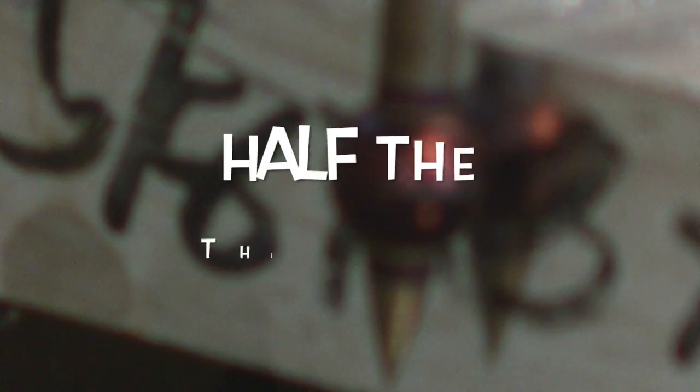All right, you can kind of see the line showed up. So at that point, it was about 2 thousandths earlier than what I had zeroed it out. But technically that's not zero — what that is, is 125 thousandths over, it's half this distance. So I'm going to say that this is actually 0.125 in the positive direction. Actually, I must be in the negative direction here — negative 0.125. Enter.